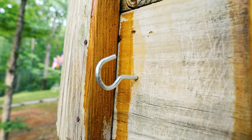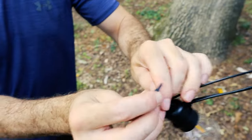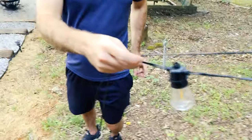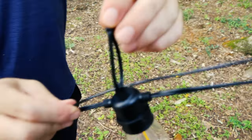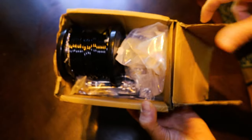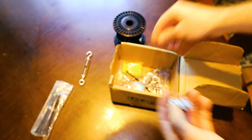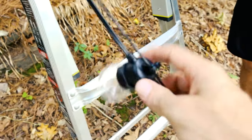With the hook side of the wire tension hardware we will hook it onto the screw hook we installed on the deck, then let our wire dangle and we'll start tying on the string lights with some zip ties. Now you might be thinking you run the wire through the little holes already provided on the string lights, but then the lights will look wavy because the holes are lined up with your wire — you need them to be perpendicular to the wire. So just use zip ties here to keep everything nice, straight, and simple. The zip ties, wire tension hook, wire clamps, and pretty much everything else you need is included in the kit I purchased, which is linked down in the description below. Make sure you cut off the excess of the zip ties to have a clean look.